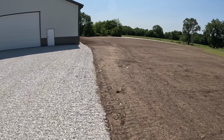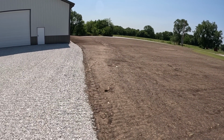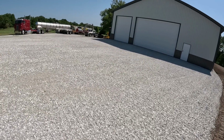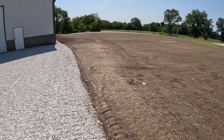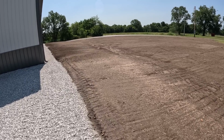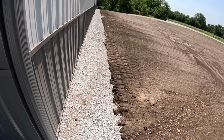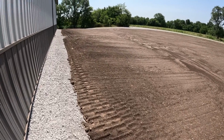It tested my swale out, so it looks like everything hits right here on the dirt side of things and runs down there, which is what I was hoping for. My high point is right here with the rock, and then I got 10 inches of fall across the drive going that way, so that's a good way to see how well it works. I was afraid this was all going to be washed out and gone, as powdery as this stuff was. He said he did have a little bit at the downspouts, which doesn't surprise me. It washed the rock a little bit there and rutted it up some, but not what I was thinking it was going to be.